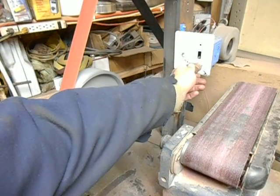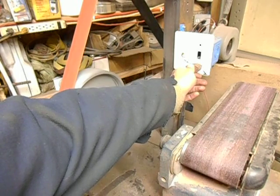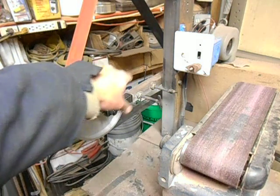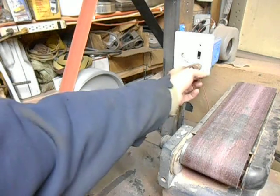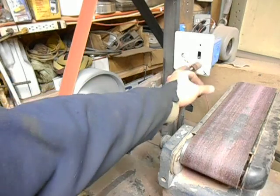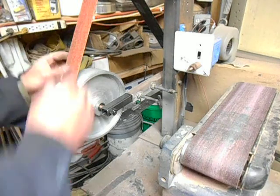I was playing with it earlier today to see how slow I could get it to go — you can almost read the lettering on the back of the belt as it goes by. That's about as slow as it goes. As it comes up, you start getting some vibration, which I think is that drive wheel. But that's nothing but a thing — I can go ahead and cast up another wheel, stick it on the lathe, turn it, and it'll be ready to go.